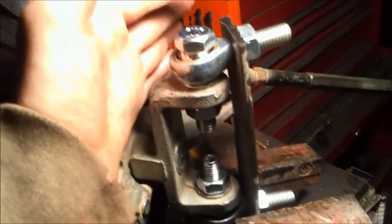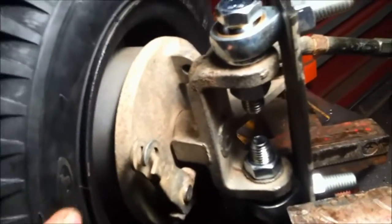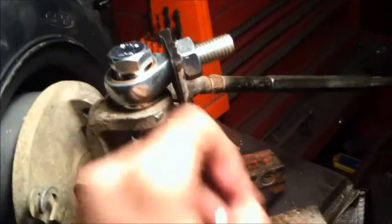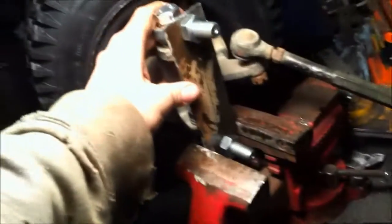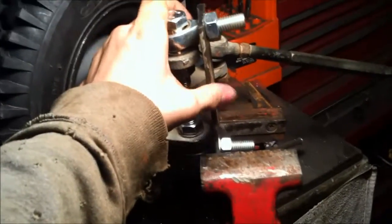Anyways, but yeah, that's how I'm gonna have the adjustable camber. It's a pretty popular setup in lawnmower racing, except mine has ATV spindles, which wasn't that hard to adapt to. So this part gets welded to the axle now, but I'm just gonna start making another one. I'm just gonna make a duplicate of this. This came out really good, so I can weld that to the axle,